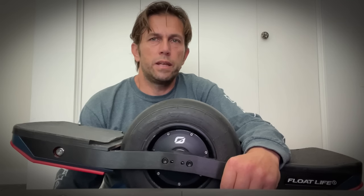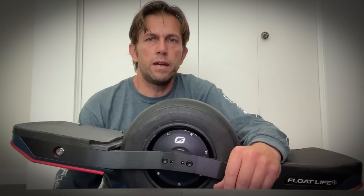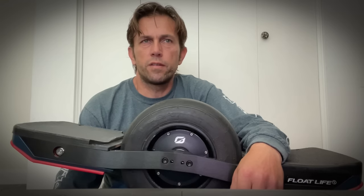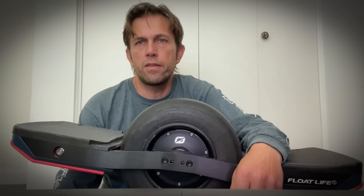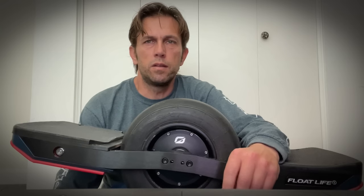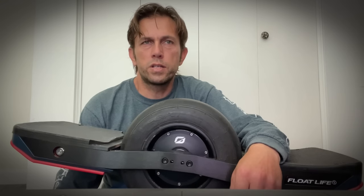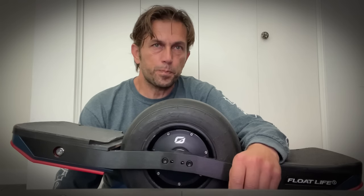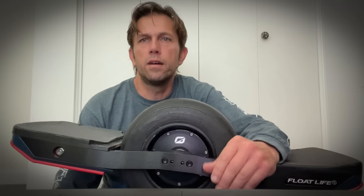You can always make your PIDs really stiff and then get good acceleration with a very stiff board — sure, that'll work — but it's not as fun to ride and doesn't have the soft buttery feel that people like, and also makes it useless for tricks. So the first versions of ATR simply prevented nose lifts when high amps were caused by acceleration rather than sheer effort like uphills or grass. I was able to distinguish that by looking at actual acceleration, and then in versions 4 and 5 I took a more refined approach where I actually quantified the acceleration, compared it to the expected acceleration, figured out the ratio between the two, and adjusted the nose-lift intensity based on that ratio.